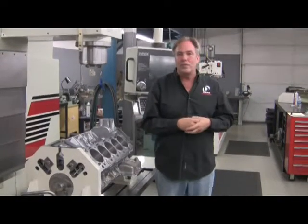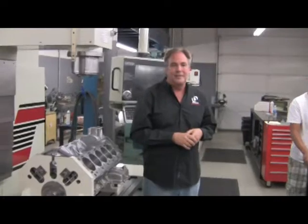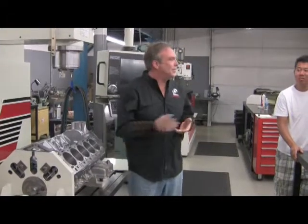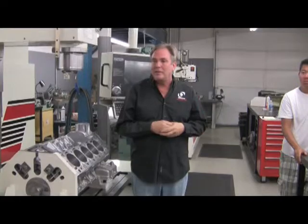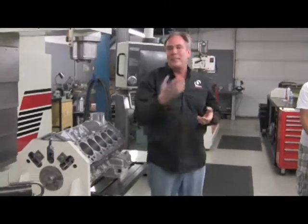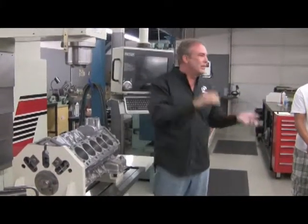Well, you don't want an iron piston because it weighs too much. So what you do is you make an aluminum piston, you spray an iron coating on it. And the bore thinks it's iron when it's aluminum. That's the secret to the process. We only found one piston manufacturer in the world that knew how to do the coating, and that was Mahle, because Mahle made the original equipment pistons for all these engines. So we went to Germany and bought pistons. Again, twice as much as pistons we could buy from Arias or JE or some of the United States.